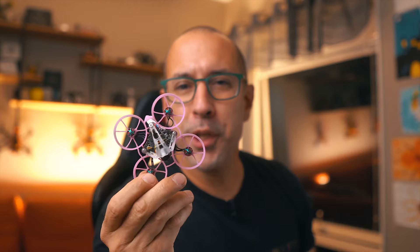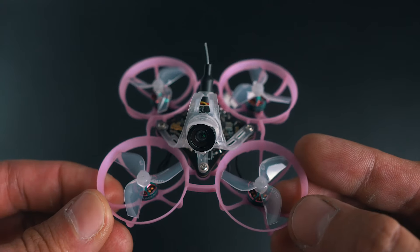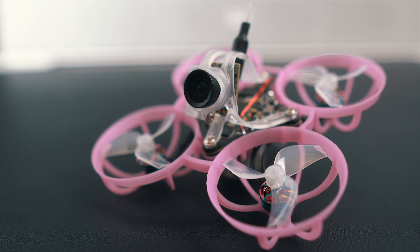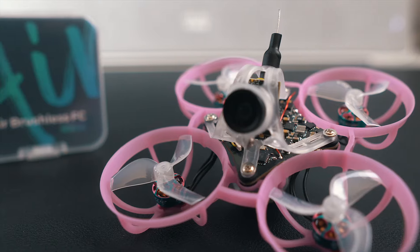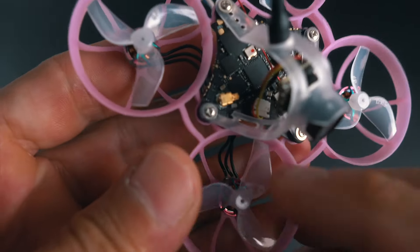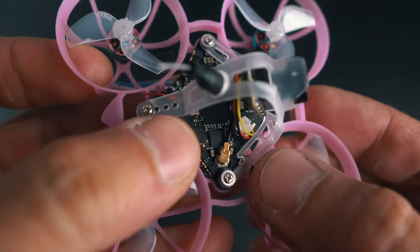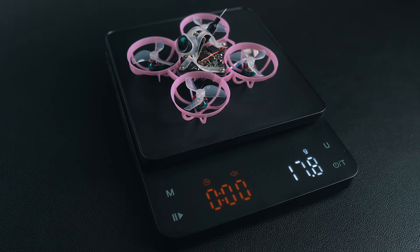It's finished now and I think it's looking pretty good. It was a bit more difficult than I was thinking in the beginning — it was not just about soldering small pads, but the negative on the power cable was a bit complicated to get in. I also made a couple of mistakes because I connected the power cable in the wrong direction, and I had to redo that. Then I found an issue around the antenna — the canopy kind of hits the connector a bit too much. I cut the canopy a bit so it frees the antenna connector. I might add a drop of glue on that UFL connector but I can do it later. For the weight, I'm pretty satisfied — under 20 grams!